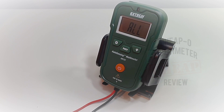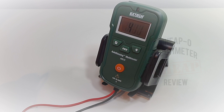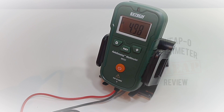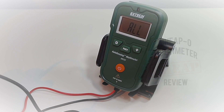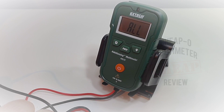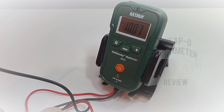Starting with a precision voltage test. Looking for 2.5 volts on the reference — it's fluttering, having a hard time staying on 2.50. Let's try 5 volts — a little better. Then 7.5 volts — again some flutter. Finally 10 volts DC reads 10.03. It's in range but it just cannot make up its mind.